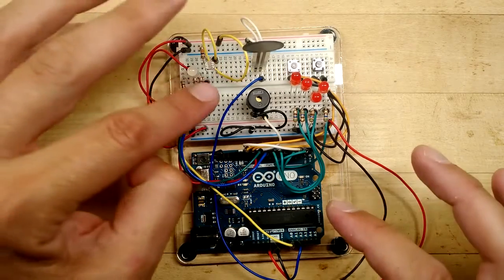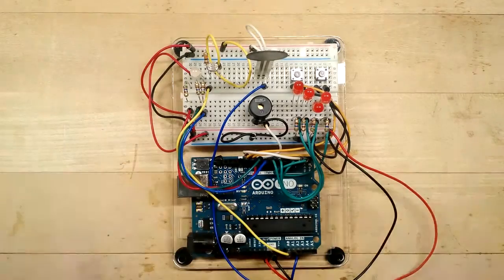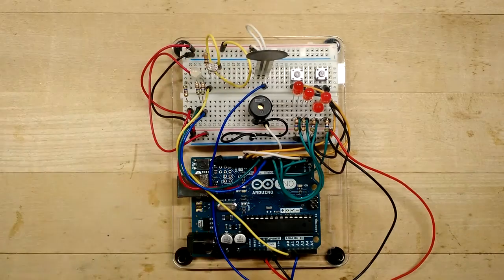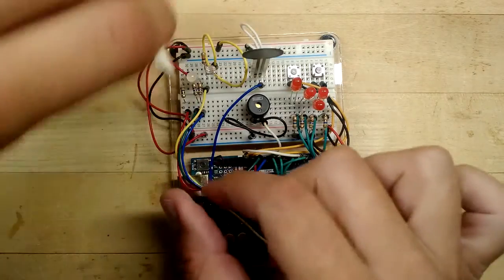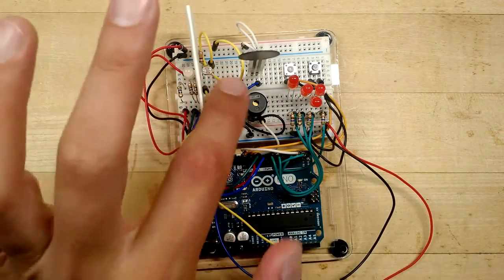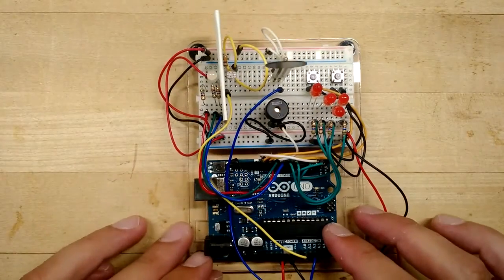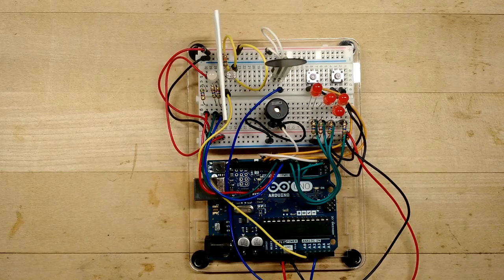So now the Arduino is going to be able to read the amount of ambient light that is present when we are running. One important thing that you should look for when you do the light sensor input is eventually we're going to make something that can test for the different colors, that can basically measure the intensity of colors. And when we do that, we're going to put in a little separator, like a piece of cardboard, or in this case, a business card, between the color LED and the light sensor. So however you have it wired, just make sure that you can get a little piece of cardboard in there and that the cardboard is kind of held in place. That's going to be really important to get accurate readings.